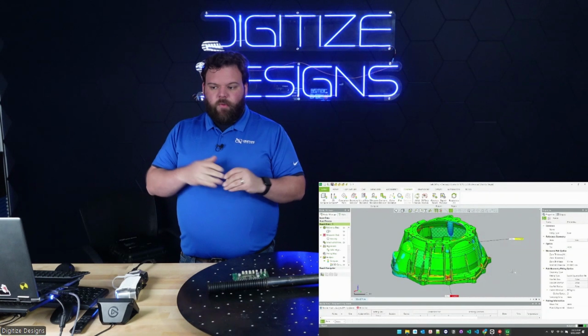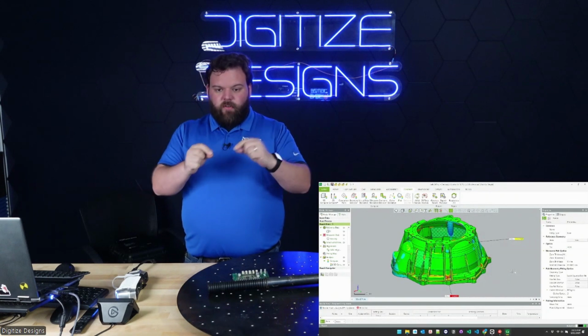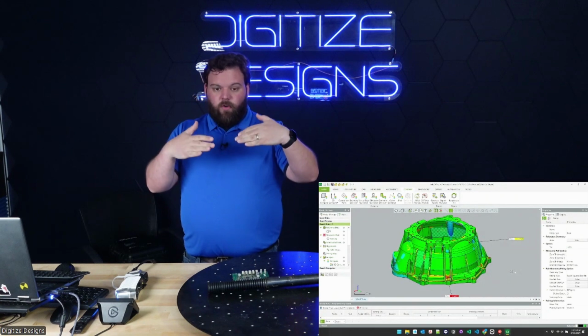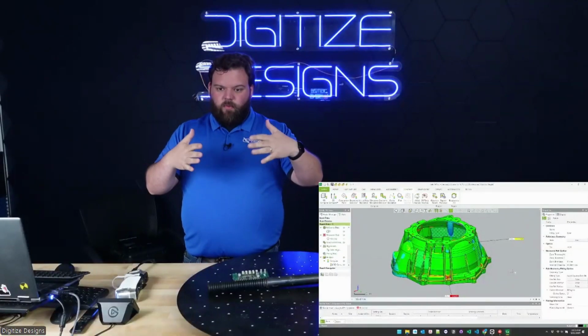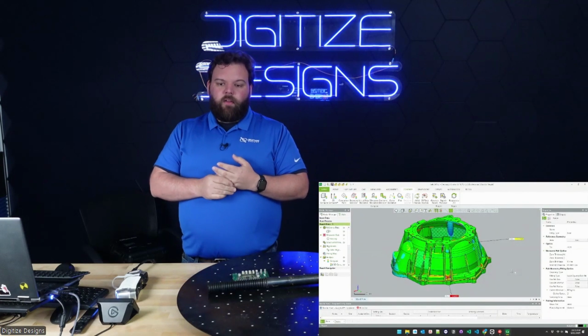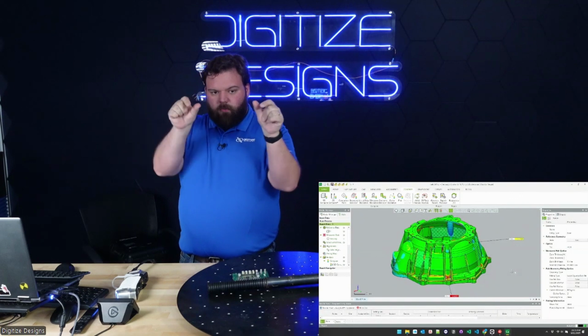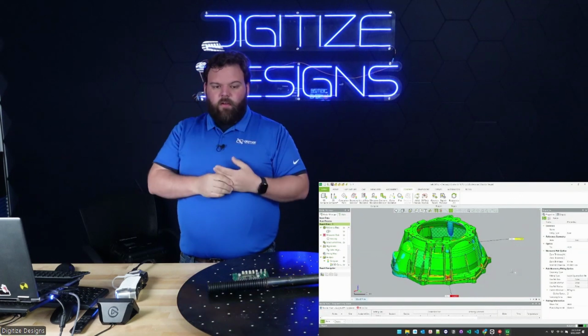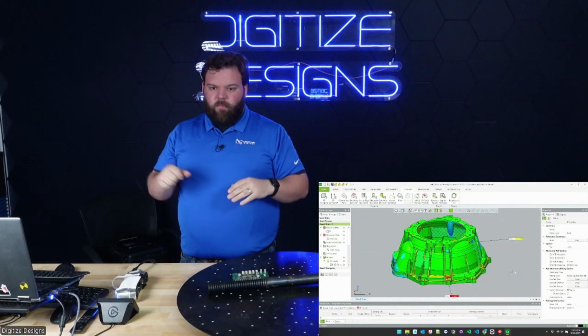Usually, what that mostly is, is the scanner's collecting both the position of all those points and their angle, like the normal direction, what angle they're facing. And usually most of the noise you're seeing is in that normal direction. We call it the orange peel effect. When you crank resolution up, if you looked at it down the side, you'll see a very flat surface, but the normal direction of each of those individual points is a little bit noisy, and so that makes it look that way.